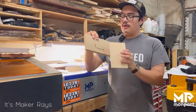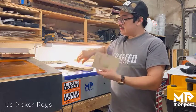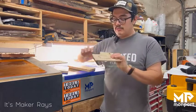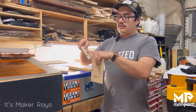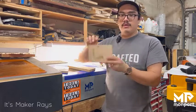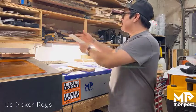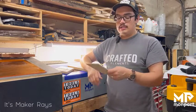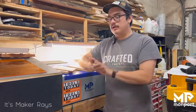When you get into things like three-quarter inch or this little-over-half-inch red oak plywood, it really messes with the settings and they get funky. You can see there's a good range where I can use a lot of different materials. Now I can write on the back of the test pieces — like '2mm birch plywood' — so I know exactly what it is. And for the 5mm piece, when I need to cut something I can just look at my test material and know exactly what settings to use.